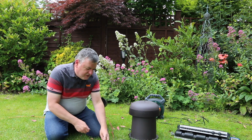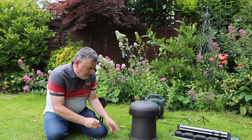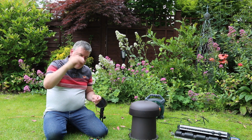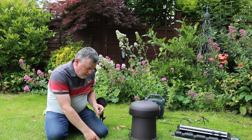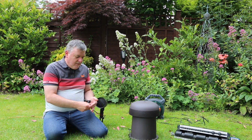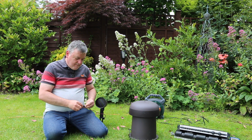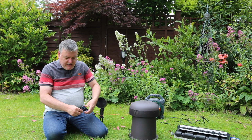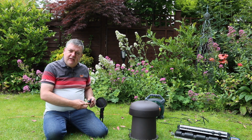So, if I'm going to wire a shotgun cable into the junction box, I simply take the outer nut off, I run it over the shotgun cable, I run the shotgun cores through the shotgun gland, I take the old gland out of the box and put the new gland in. And once I've done that, I tighten the outer nut over the gland, which compresses it correctly and makes a water and dust tight connection.